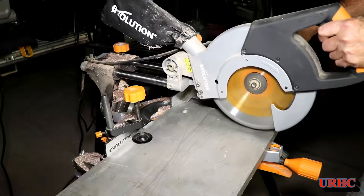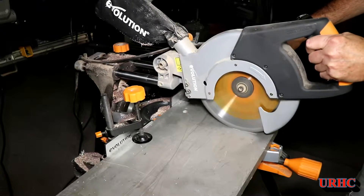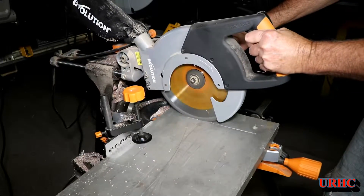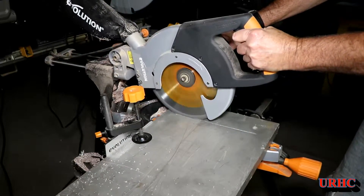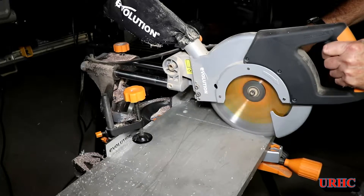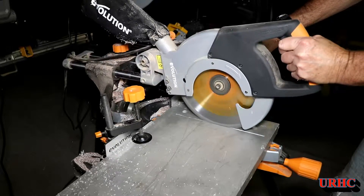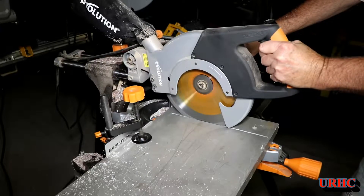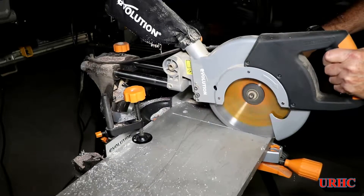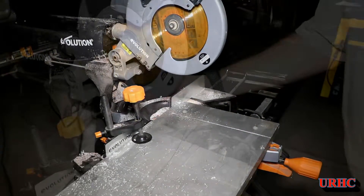In this video I'm starting to build some parts for the CNC router, beginning by cutting one-inch thick tooling plate in the shop. This piece is about one inch by 12 inches wide, being cut with the Evolution Rage 3 saw. It was definitely a challenge - the blade is a multi-cut blade not made for aluminum, so I had some problems with the teeth filling up. I had to let it cool down a couple of times after tripping the thermal.